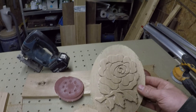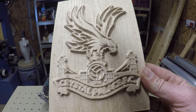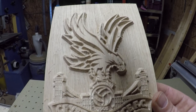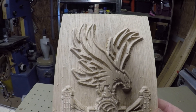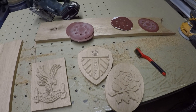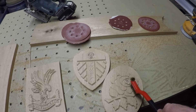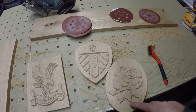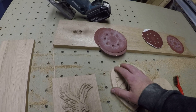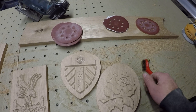Things like these are just a given - they come out really, really well. And then you've got something like this Crystal Palace plaque where you can see the detail is very, very fine. Really happy with that - that eagle looks absolutely superb. These don't come off the SmartBench ready to put in an envelope - they don't come off any CNC ready to go. It's just going to be a little bit of time cleaning up edges with a wire brush, going round with the orbital sander, finishing off with some hand sandpaper, and sometimes a little bit of Dremel action to clean up the last little bits.